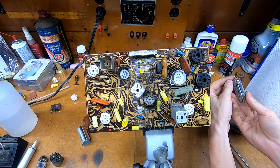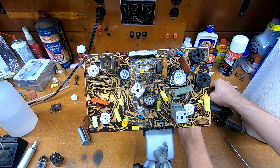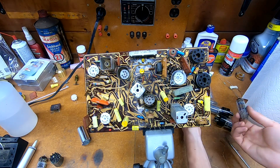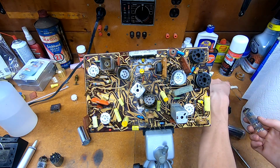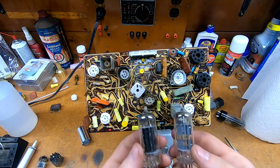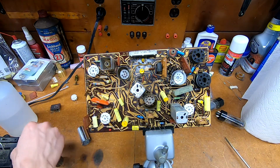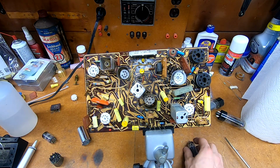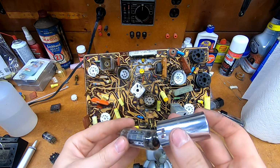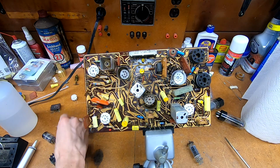It would be... is it the 6DR7? 6AW8. I can't quite remember which one of these. I want to say it was the 6DR7 here. Or the 6CG7. Well, it was one of these guys. Either way, these are substantially taller, or they're just tall enough where trying to put one of those shields on there doesn't quite work. The locking tabs don't engage, the spring compresses, and then, of course, it actually tops out completely on there, and there is no way to get it on.